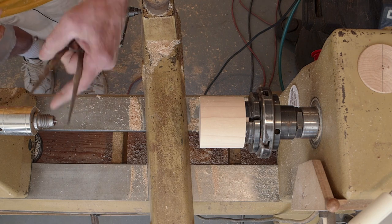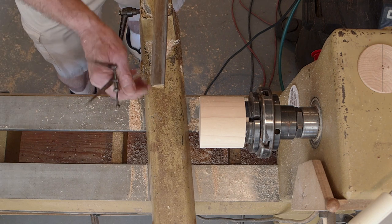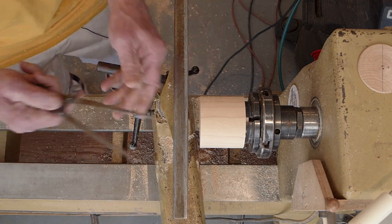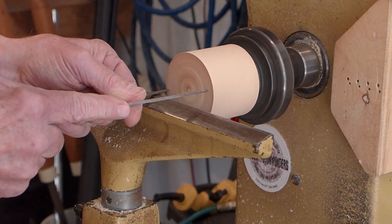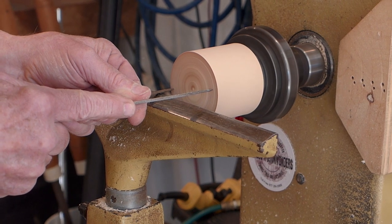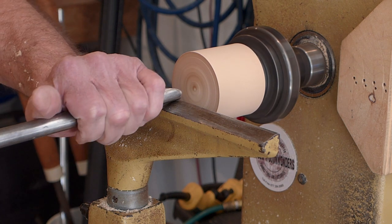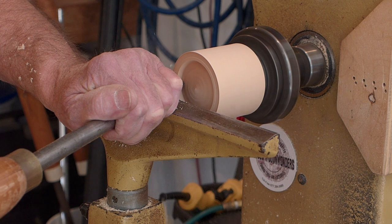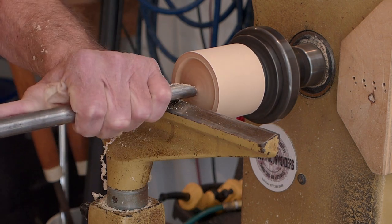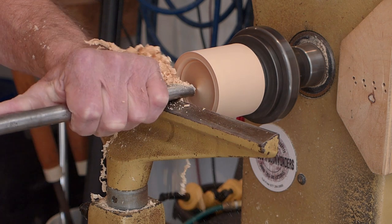Get this tailstock out of the way, because this thing right here has created a lot of scars. And if we see right here that we've got plenty of wood to work with, so let's score this. Right about there. Again, don't let this end hit, or this is going to go that way. Now we get to hollow that out into a hemisphere. We get close to that line we just put on it. We're not going quite there yet. We'll step this in.